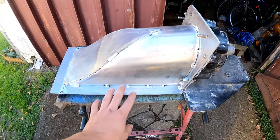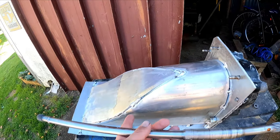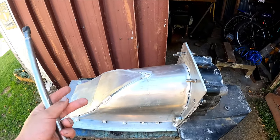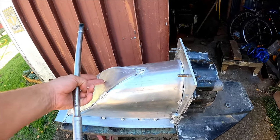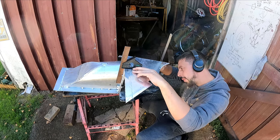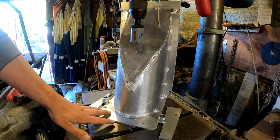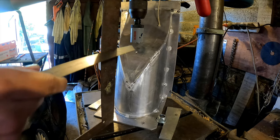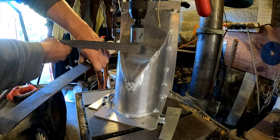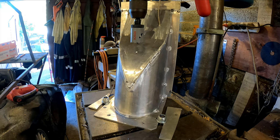Mostly all tacked together. I'll put a ridge around the outside so I can bolt it into the boat. A tricky thing is I have to drill a hole in here for the shaft to go through that drives it. I'm going to figure out a way of measuring it so I can drill it in the drill press. I've splashed out and bought a brand new hole saw. Got this clamped in here, squared off this edge to the center and the back face edge to the center, so hopefully it's dead right. Might throw a couple more clamps on and start drilling.